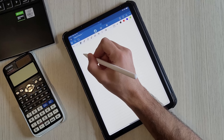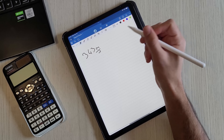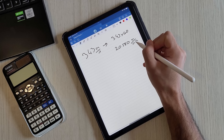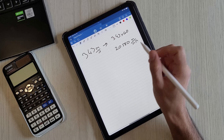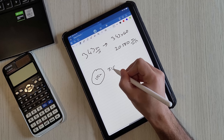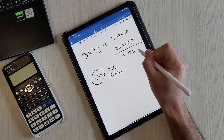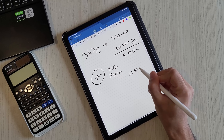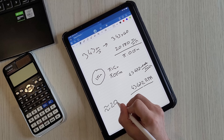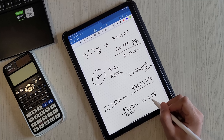The speed we are trying to reach is the speed of sound, which is 343 meters per second. We convert this to RPMs: multiply by 60 to get 20,580 meters per minute, then find the circumference of the gear — pi times its diameter of 0.15 meters. Dividing gives us 43,672 rotations per minute. Since we also have our input speed, we divide output RPMs by input RPMs of 200. The RPMs cancel out and we get a gear ratio of 218 — meaning for each rotation of our input gear, the output gear needs to turn 218 times.